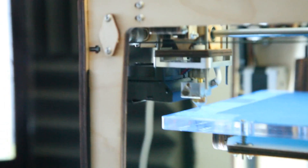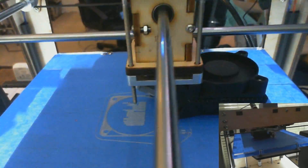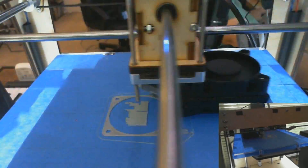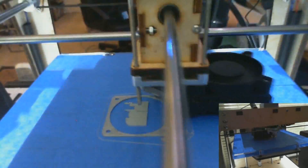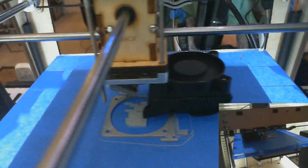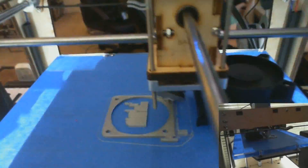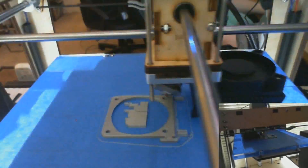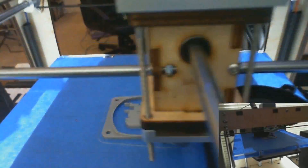Here you can see the old one on the printer — not really much to look at. So we're going to go ahead and print out a brand new one. In this video we'll have the Ultimaker right here printing out something I downloaded from Thingiverse. The URL is in the description. The new fan shroud is designed a lot better — it puts the fan at a slight angle so that the airflow is actually towards the printhead, and not flat down at the bottom of the shroud like the stock one, which is still on the printer as I'm printing right now.